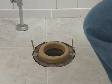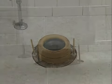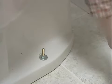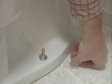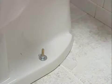If you're doing a bathroom floor and you've raised the overall floor height, you may end up having to use 2 wax rings when you reinstall the toilet. And when you're installing a toilet onto a tile floor, use small plastic shims to keep it from rocking. Eventually you'll have to cut off the ends of the shims and caulk to fill the joint between the tile and the toilet. Now, don't use plumber's putty. It could stain the grout.